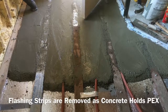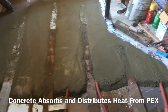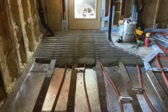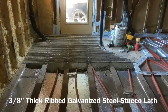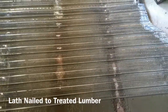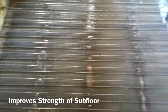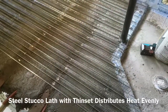We're putting in concrete — make sure it's a nice, not-soupy mix at all because this isn't a full two inches, it's just thinner than that. There you have the metal lath stretched over it; it'll harden up and the lath is just over the top. Then I put thin-set and tile right there, and that metal will also help to conduct the heat across the floor more evenly.